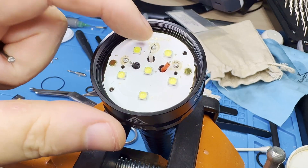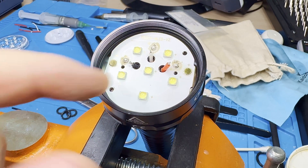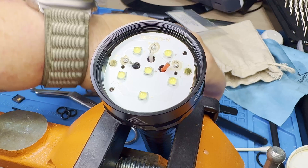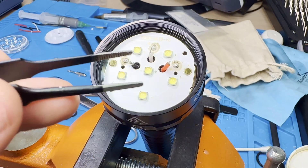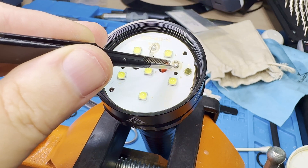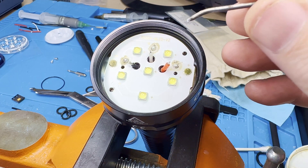I just unsoldered all these leads, and Olight makes really great quality lights. These are some of the better wires I've seen in any production light: to get this solder melted you've got to go pretty high, about 380 degrees or so. I'm holding the jacket here and pulling until it loosens, and the jacket withstood it. There are a lot of strands in here for high current. They make good stuff — I know it might sound like I'm a fanboy, but it really is just high quality.